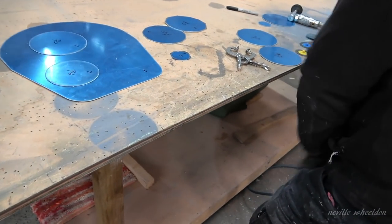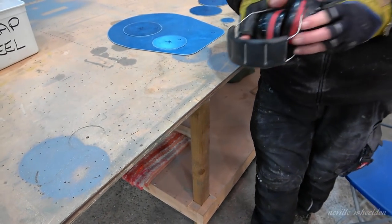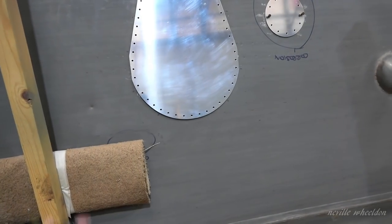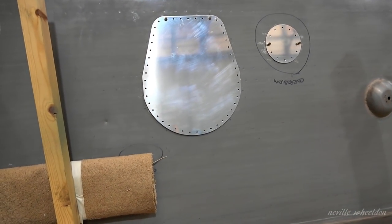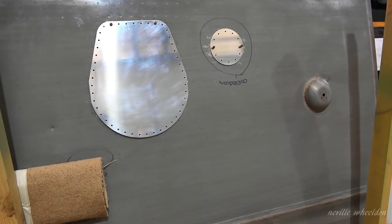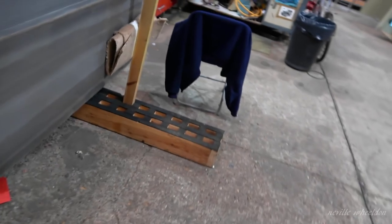What are these from? These are off the fuel tank. It's going to be sent away. What they need is pressure blanks, so when they've done the repairs they can pressurize the tank to make sure it doesn't leak. If you sent it down there they'd make the pressure blanks and probably charge you about 200 quid a blank to make them.